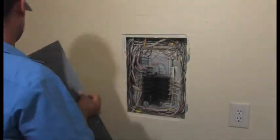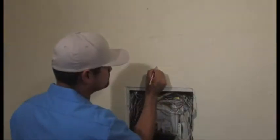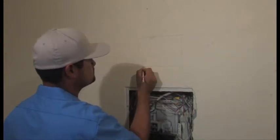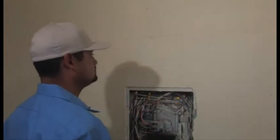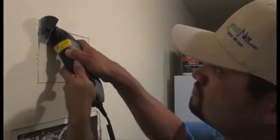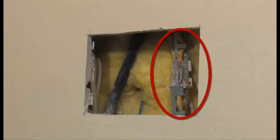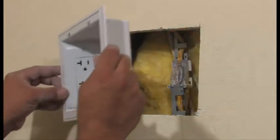The G-Meter is located near the home's main electrical panel. The location must be close enough for the leads from the CTs to reach the G-Meter. In this case, the meter will be located just above the breaker panel, allowing for easy running of the leads. It may be necessary to tap into an existing 120-volt line for the outlet in the recessed G-Meter outlet housing.